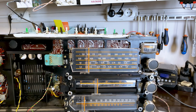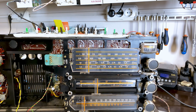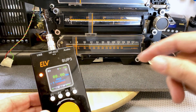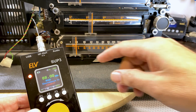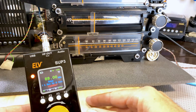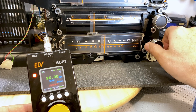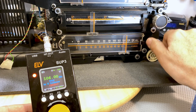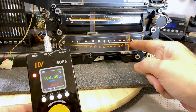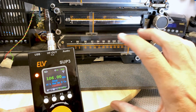I've done short wave 1 and 2 in exactly the same manner. The only difference is that I connected the signal into the rod antenna terminal as the service manual instructs. Now out of curiosity, I wanted to see what the FM was like. I've got this thing sending a signal at 88 megahertz with a tone on it — I've only got a little wire as an antenna. It's exactly on 88. Let's try 96 — exactly on 96. Let's try 106 — it is right on 106. The RF alignment of the FM, at least as regards the oscillator, is perfect. I'm not going to touch it.